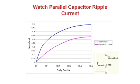That may actually cause you to fail the rating of the capacitor. For instance, I took a buck power stage, put in sufficient ceramics, and then put an electrolytic capacitor in there. I calculated how much RMS current was in the aluminum capacitor in parallel. In this particular case, at 50% duty factor, I had most of the ripple current in the electrolytic capacitor, and there was not sufficient current rating for the capacitor to handle this much current.